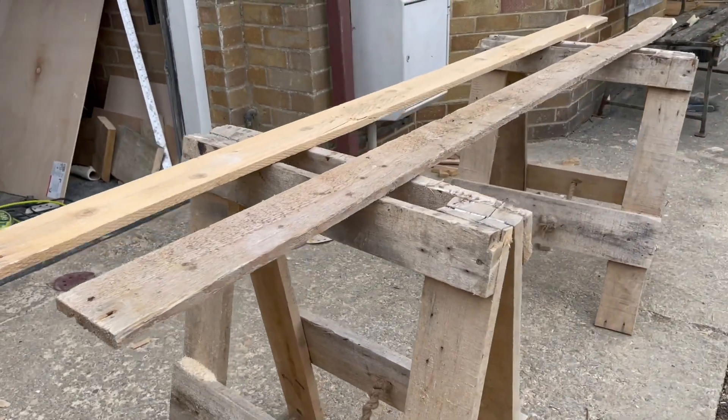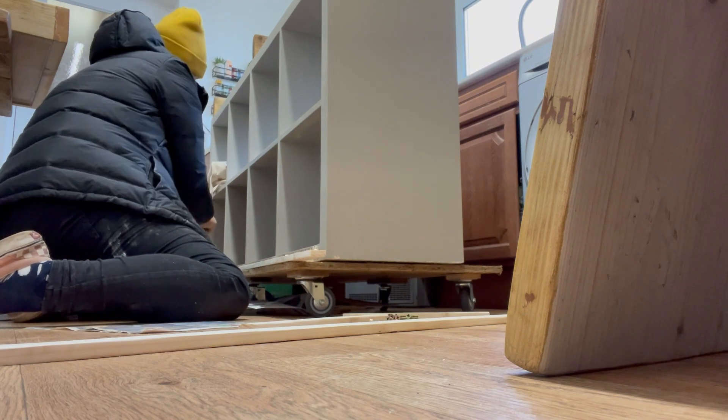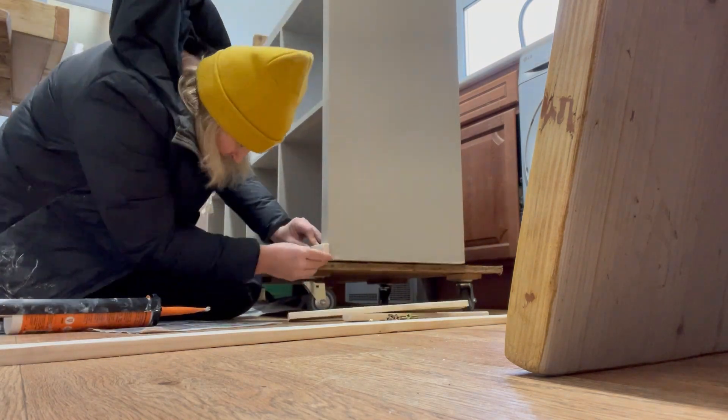I'm hoping this is going to be the last day of making the breakfast bar. I need to put the pallet wood around the bottom for the trim, just to tidy it up and match it. I've been avoiding it because it's really hard to cut pallet wood into thin strips — my table saw is at someone else's house. I've sanded it down, cut it to size, and actually it didn't take as long as I thought. These pieces are all sanded and ready to be glued and screwed onto the bottom of the Kallax, then I'll Osmo oil them in the same Honey colour.